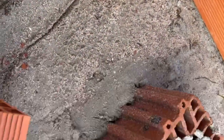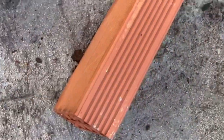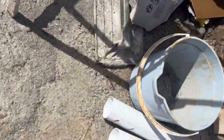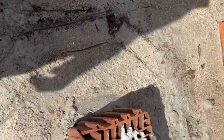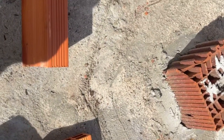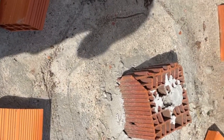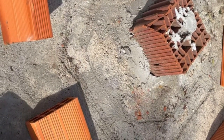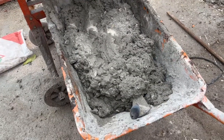With those removed I can clearly see where I need to do my concrete ring. I'm going to make a rough concrete octagon, follow the scratchings, and get it nice and level. As you can see it's a very rough floor at the moment, so putting concrete around there will give me a nice flat surface to do the brickwork on. The concrete mix is now poured.